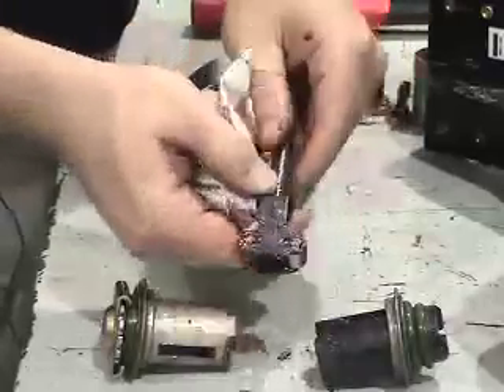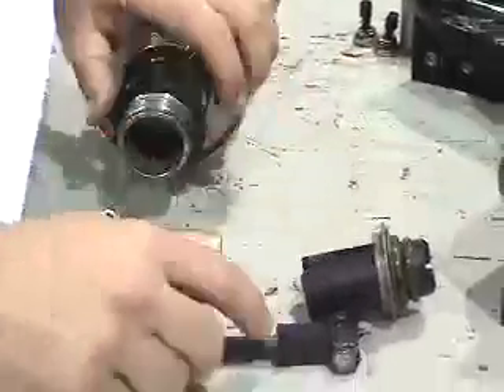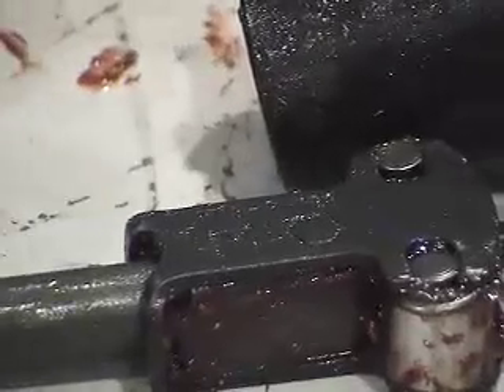Just there is a part number here. It's important that you double check that you have the right wedge in there, because the wedges come in different angles.